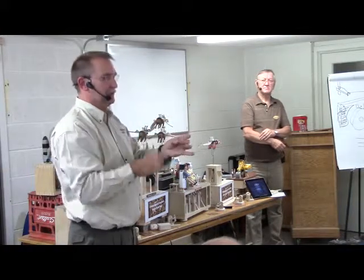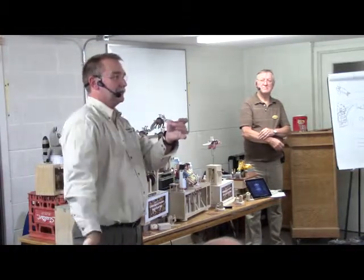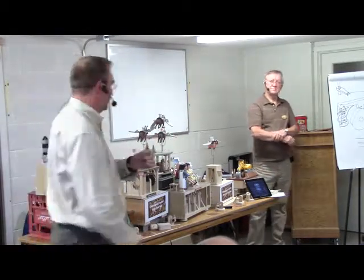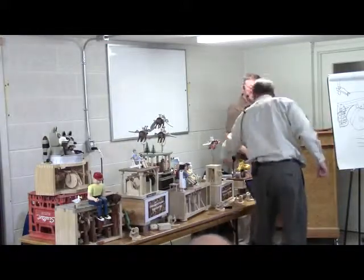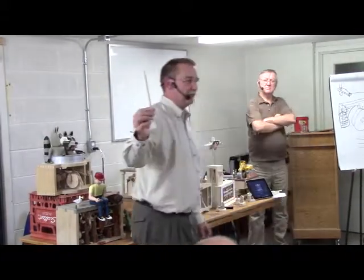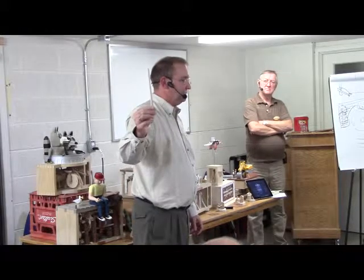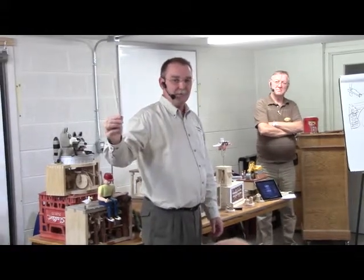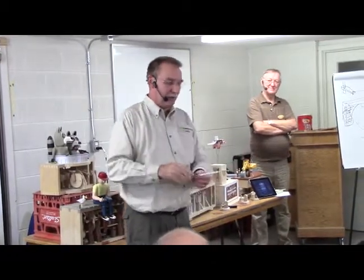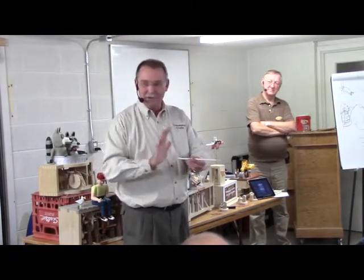I always find that unless you're drilling a short length of dowel, when you go to drill the end of the dowel, it's hard to keep the drill from going cockeyed anyway, so it's a challenge. I try to avoid drilling long dowels. The only thing I will tell you, because people always want to know this one, is that this dowel has a 1/4 inch or a 1/8 inch slot cut in it. That's a finger loser if I ever saw one, right? I used to do these on my 10-inch table saw, under a block. I'd cut a 1/4 inch rabbet in, I'd put this in, and it would still want to jump out the back. I used to have to put something behind them.